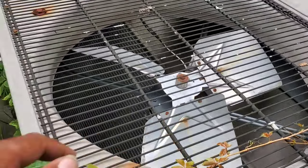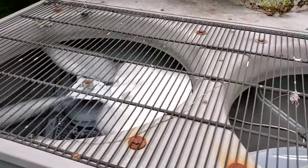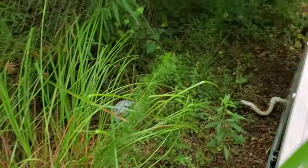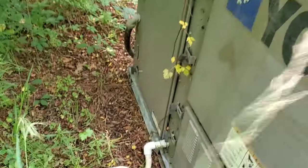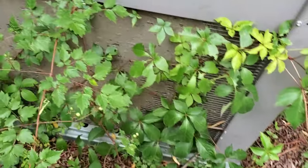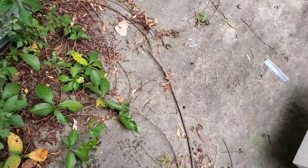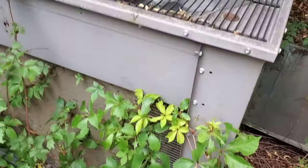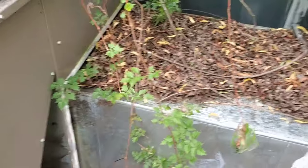Three running. That's probably a bad condenser fan motor — it may be on a pressure switch. That kind of got me there — another blanketed coil.